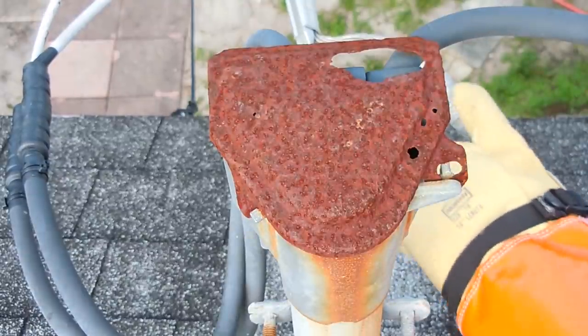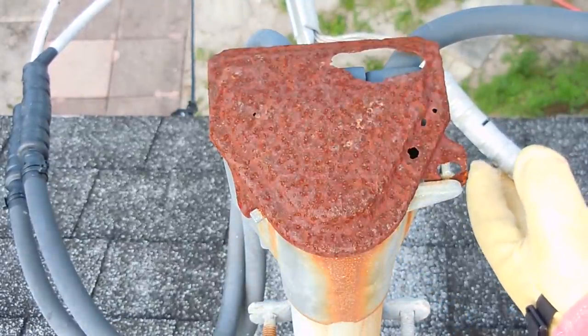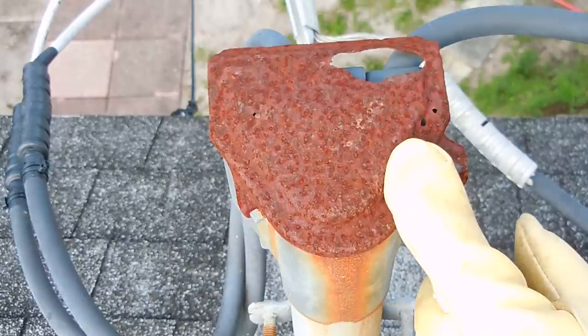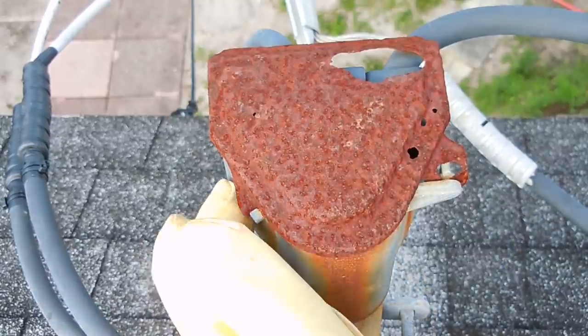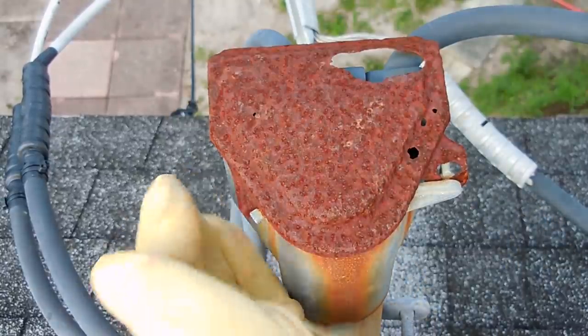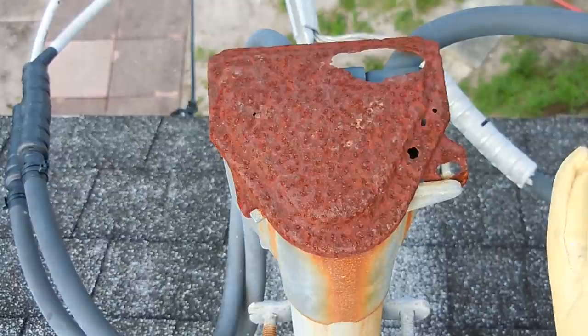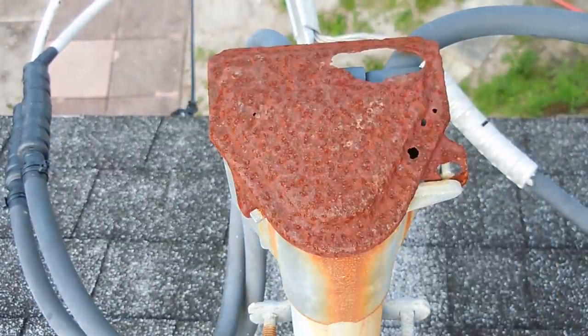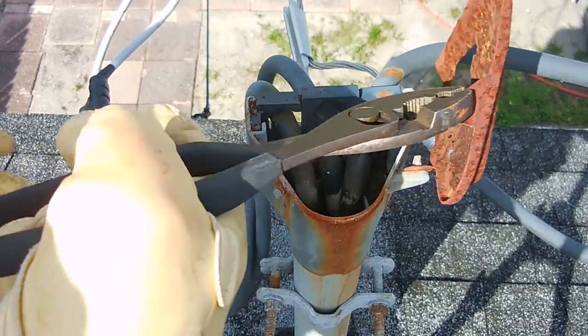Over here this one's fine — it's neutral, you do not have to cover it. It's connected to earth ground. Now the top of these weather heads usually rot out like this with age, and there's a little lever here you could pry up on, and this whole thing pivots open, allowing easy access to the conductors inside the weather head.